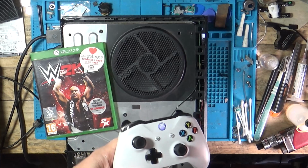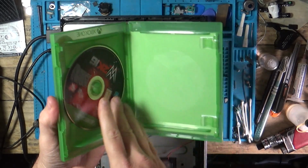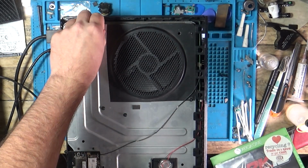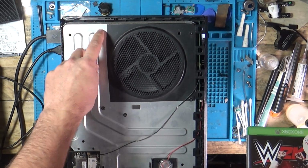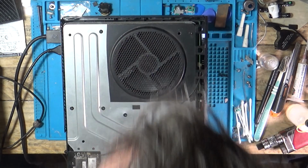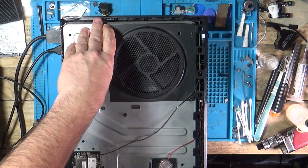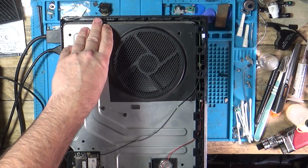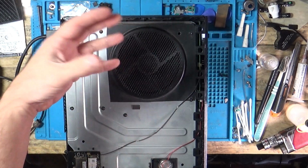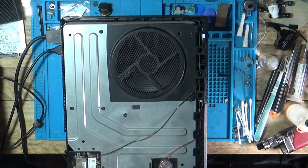Right, so there we go. That one is working. Although, is it sellable? Who knows whether that's sellable? I wouldn't be really comfortable in selling it. Although, you know, it's a repair, it's a good fix. But with that trace bar running around the back, there's a small chance of it shorting out onto the ground rail, even though it's enamel wire and we've double insulated it with our conformal coating, our solder mask.